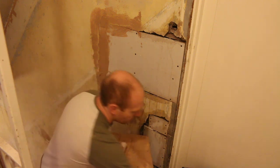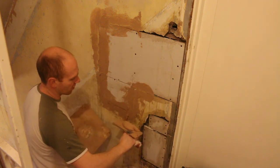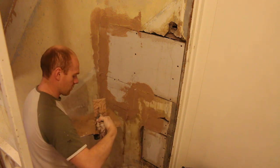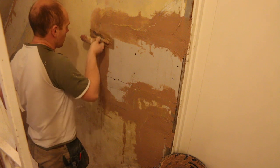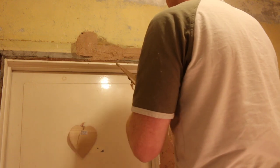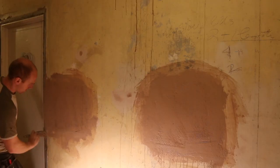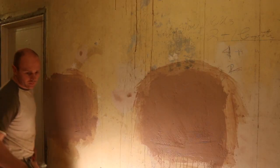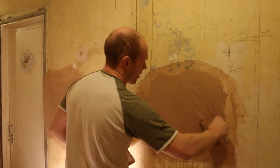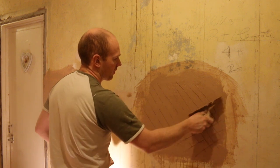With the bonding first, that should help give us a nice smooth wall overall. I can do the bits that nobody sees. At the very last step, once it's got a little bit of firmness to it, just run some grooves down it — and you only want to do this if you're skimming anyway.